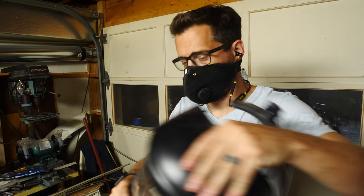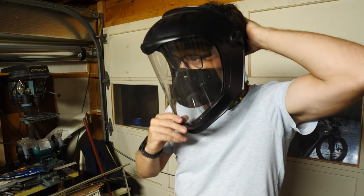They usually also have a guard on them that does come off, but that's really not a good idea. Sometimes the discs on these things tend to explode, and that guard can save your face. So if I were you, I would always keep the guard on the grinder. Speaking of things exploding into your face, it's also a good idea to have a full face shield when you're working with a grinder. The disc itself could explode, but also just using the tool throws debris everywhere, so it's a good idea to be fully protected.